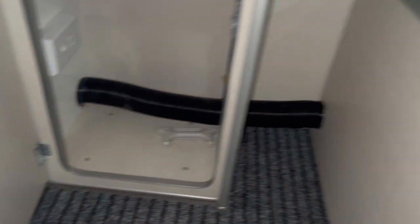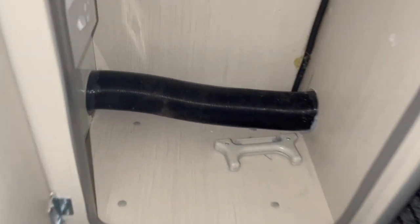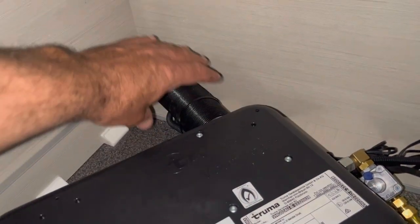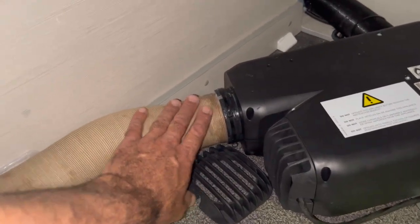One thing when you're drilling through cupboards — it just looks like this wall and this wall are all the same level, but they aren't, because this wall and the opposite wall are the same but the cupboard kicks back about 30mm. You can see the gap down there. So measure 100 times before you drill a hole, because if I'd punched it to the back of the cupboard where it looks like, I would have hit this part here and there could be wires behind there. Anyway, we got that through and this is where we stuck the Truma heater — on an angle like that, so it feeds in nicely with no tight bends. The hot air duct blows out on a nice angle, and you've still got stacks of room around here to put stuff under the bed.